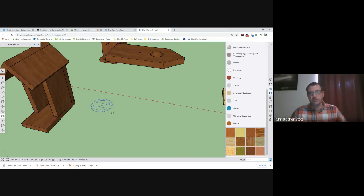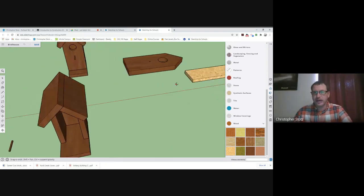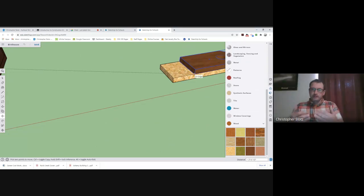Now I'm going to move it and lay it down. I kind of move my view to get a nice view, click on the side of this, click again, and then I can lay this flat like that. You just have to play with that protractor rotate symbol a little bit to get it to move the way you want it to. Once I get this done, I'm going to move this onto the top of this board. I grab the board I'm going to move by the bottom corner, then come down to my regular board — it automatically snaps on one edge. I'd snap it to the edge closest to you, just to keep everything in one line.